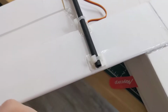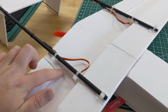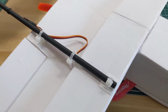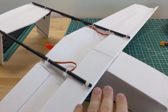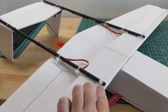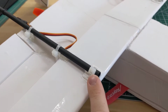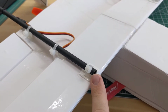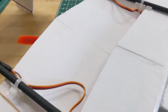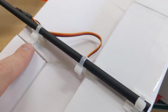And then you can see that I had to repair the wing here because the plane crashed after its first flight. And when it crashed, the fuselage stayed sort of level with the ground, but the tail flared up away from the front of the wing. So to mitigate that tendency, I've got a new zip tie at the leading edge of the wing here, and I've extended this carbon spar forward, the carbon boom, and then I have 2 zip ties along the middle and the back of the carbon fiber rod.